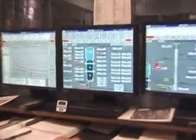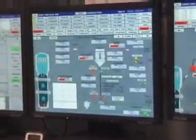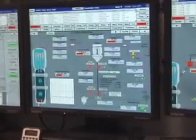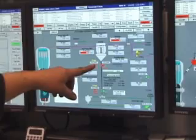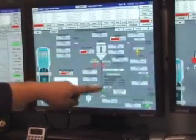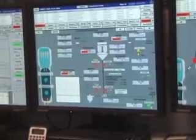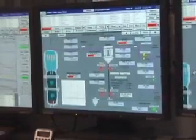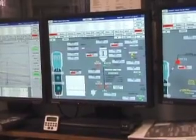The next screen goes over to cyclones. The product gas comes out of the reformer and gets separated again in these external cyclones. Any dust is then cleaned out again, thrown into this big hopper, and then the product gas goes over to our boiler. Any dust gets separated out through a series of lock hopper valves and a pump head. We take it from our dissolving tank at the bottom of this system — open and closed valves so no product gas gets dumped out. We just take out the dust and it goes to the dissolving tank.